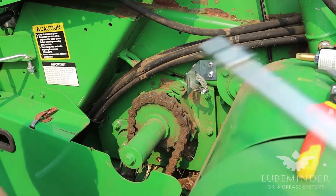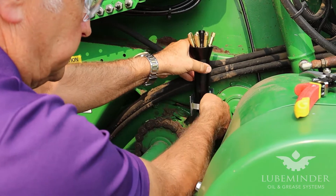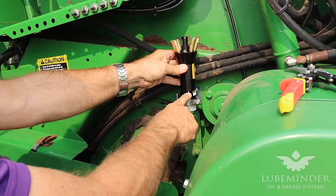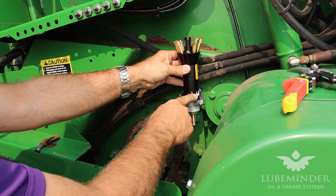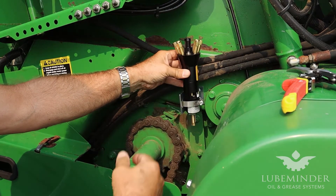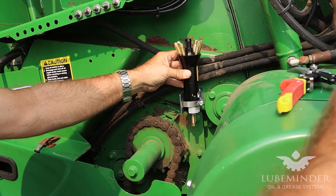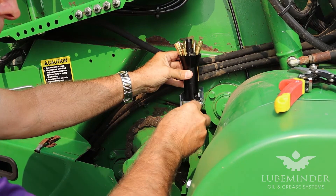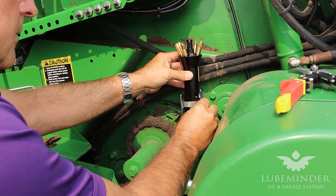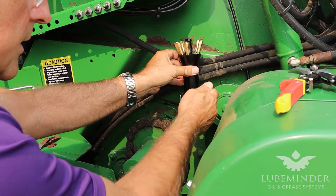That bracket's nice and solid. I'm going to leave the pump loose for right now and just position it. You can see there's an opening right here where a hydraulic hose is going to come in and route back to a cylinder on this machine that'll actuate the pump when the machine is in cycle. So I'm not going to totally tighten the pump — I'll just leave it snug so we can position it in the right orientation.